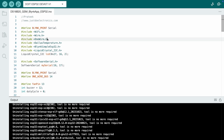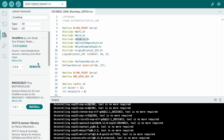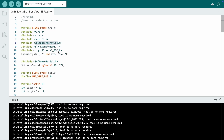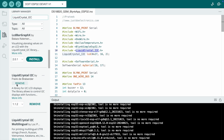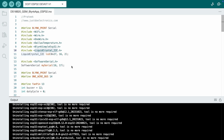Now I explain the code. First, install a few libraries: the OneWire library, the DallasTemperature digital temperature sensor library, and the LiquidCrystal I2C library — if you are not using the LCD, that last one is not required. Add these libraries and then connect the GSM module to pins 16 and 17 (UART2), and the temperature sensor to pin 14.